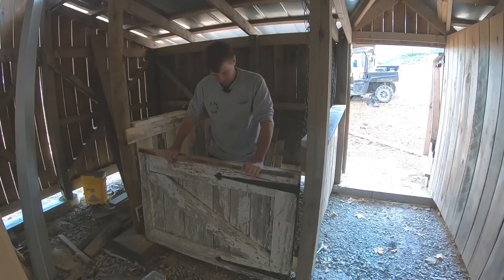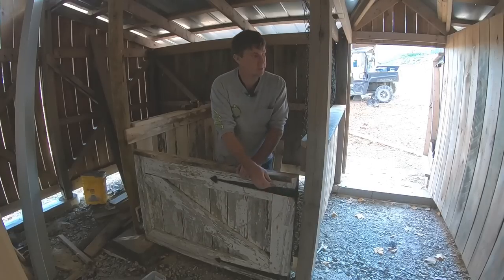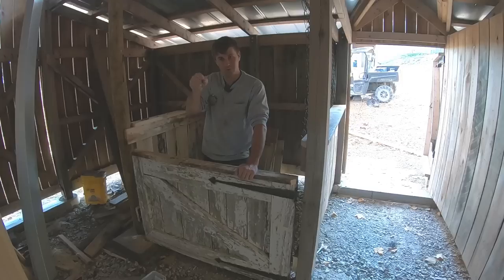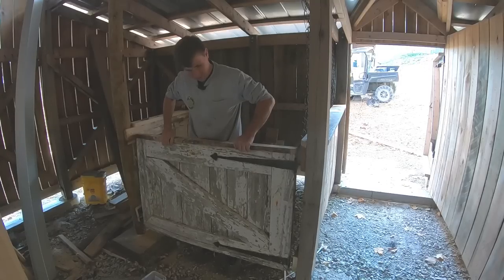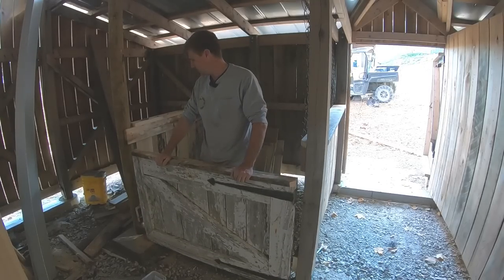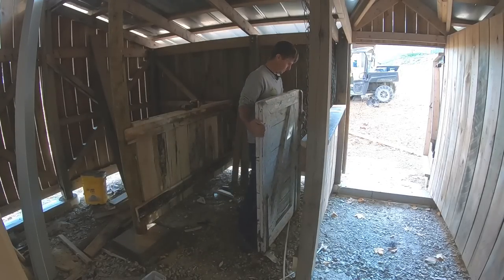Boy, she'd have to be some heavy hinges though. It's a heavy door. Could always do a cable hinge, do some strap hinges down there, and then a cable hinge off an eyelet on the top too, to help this side with the turnbuckle in the middle. That would support it. It would be a really good look though. I think it's worth doing. Kind of just wanted to try it out and see how it's gonna work. Flop this up out of the way for now.